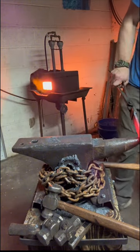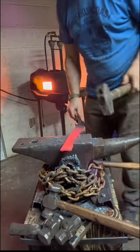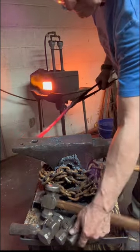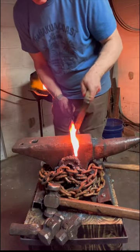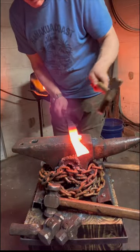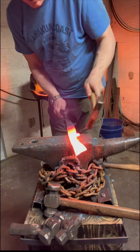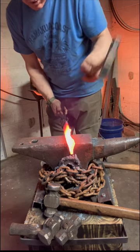During this process, I'm constantly trying to clean up those two, the choil and the ricasso area, both in front and behind the guard, because that little cross peen just makes a mess. Which makes me think, maybe I should take this to the grinder and address the peen side of this little hammer. Might be more effective and useful.